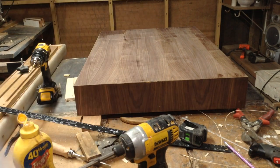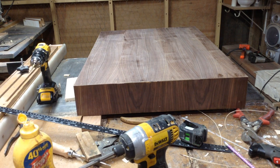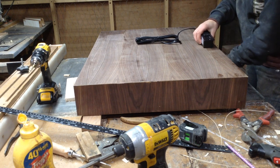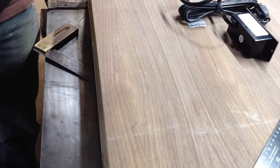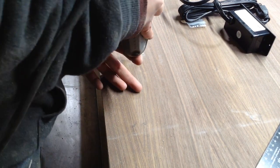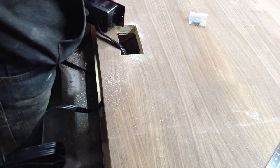The customer wanted one of these electrical sockets in the tabletop, which I think is a nice addition to any piece of furniture. Before putting the final coat of finish on, I cut out a slot for that. I usually use a jigsaw for this but recently I've been using my oscillating tool - it gives a really nice clean cut, whereas the jigsaw tends to chew up the edges a little bit. I'll mock this in place and take it out to finish the cabinet.